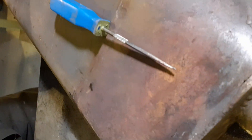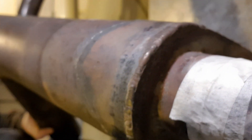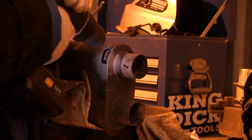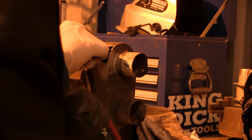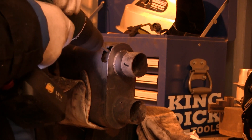You can also see on the side a previous repair that Aiden carried out. So yes, that's going to need repairing. It's nice to spot them early like this before they become a massive hole — you don't want any carbon monoxide getting into the cabin. Over to the welding bench now. It's no good just trying to weld up a tiny pinhole — the material is eroded and we need to get all the weakened material out, which is what Aiden is doing, cutting it back until he finds good metal again.